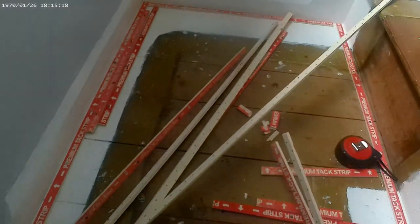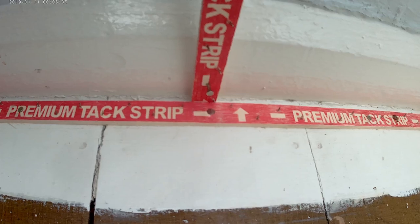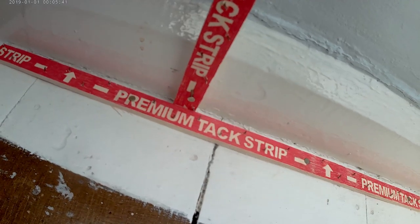And now we're going to push on and cut the grippers. The width of the gripper stick that I'm cutting is 59 centimeters. We're also doing a top landing as well, or should I say a half landing, which I am grippering.